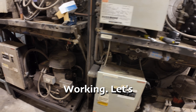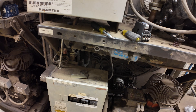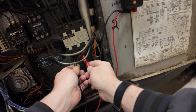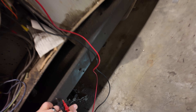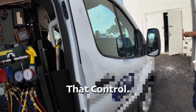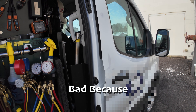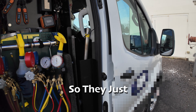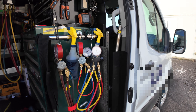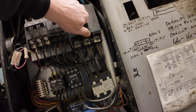Okay, got that one working — let's see what we can do on this other one. Looks like it's full as well. I've got two or three different systems down, so we're just going through and finding if it's the same thing over and over. I'm slowly coming to the realization of what's going on — you likely lost power to the building and it caused it to burn up that control. One phase is working okay, but a phase loss is really bad because there's no phase protection on those, so they just try to run and that burns them up.